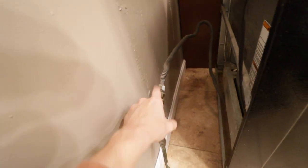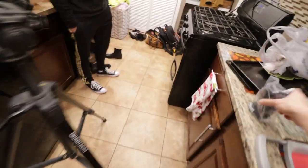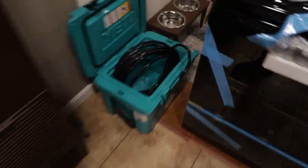I have the gas shut off. We turned one of the burners on to burn off any extra propane. We'll disconnect that and cap it. Then we're going to be using a surface-mounted 240-volt 50-amp receptacle, which I have right here. And then we have $230 worth of wire.